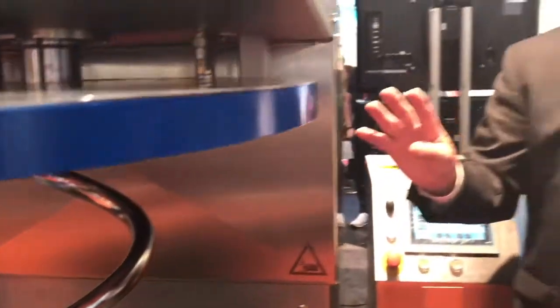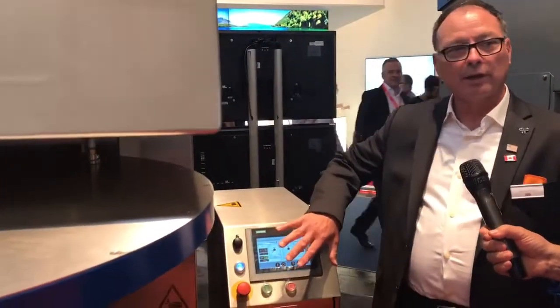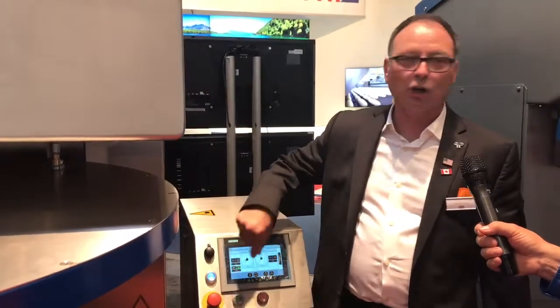And what that temperature probe does a couple things. First of all, you don't have one in your pocket that ends up in the dough anymore. It's also reading the center of the dough, which is the accurate temperature of the dough, versus when you just stick the outside of it. But it also comes up in here. A lot of bakeries, when they finish a dough batch, want to record the temperature. It's already in here.